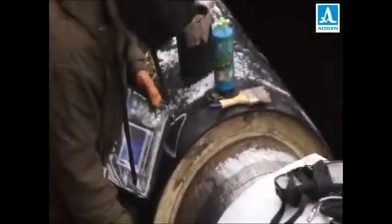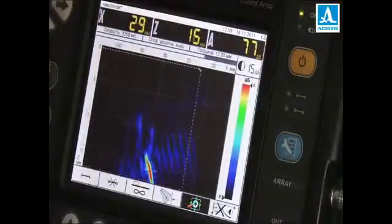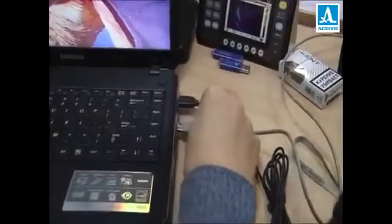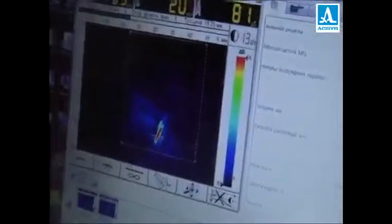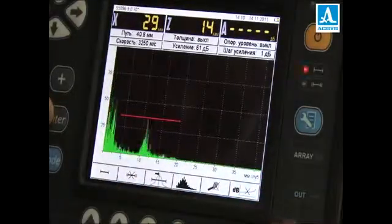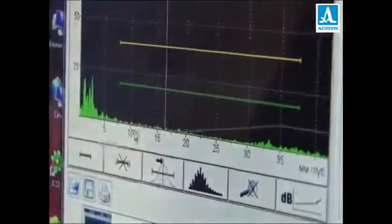The large colour display can operate in bright sunlight or in the cold down to minus 20 degrees centigrade. The screen shows a large-scale cross-section image, coordinates of flaws and signal levels. Measured results are saved to non-volatile memory and can be copied to an external laptop by USB cable. You can switch the IntraVisor to classic flaw detector mode any time you need it — the device works perfectly well with all classical transducers. Just like tomograms, all A-scans can be saved to memory, copied to a laptop and used for reports.